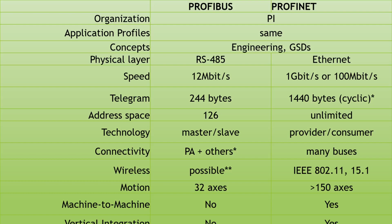Big benefit here is this is like a $10 board compared to a $1,000 PLC, and the software is free. Downside is there's not as good monitoring for it. Most Arduinos you can't see what's going on in the code, whereas with the PLC we can go, oh look, this output's on right now, and I can see that in the code. And why is it on? Oh, because these things are true. That doesn't exist on most Arduinos. I think there are some with those debug interfaces. I don't know if there are Arduinos though. Other microcontrollers, yes. But it's just, to me, something really interesting.